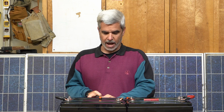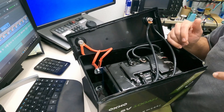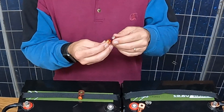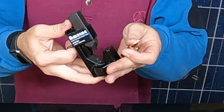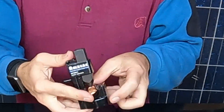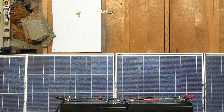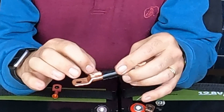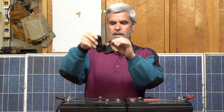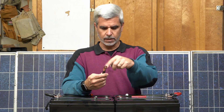If you saw my previous video, I received a battery that had been smashed a little bit open — it basically just broke the glue holding part of the lid, so I broke it the rest of the way off to see inside. Once I get them out, you have to be careful to get all the strands inside. This is a spring-loaded swaging device — you get it lined up right on the center point where you want the crimp to be and then smack it with a hammer. On that third and fourth whack you can hear the tone change, which tells you you've gone all the way through and now it's solid metal from top to bottom through the copper. The kit even comes with heat shrink.